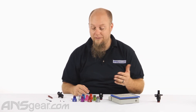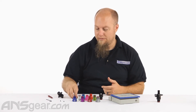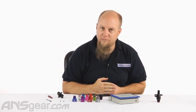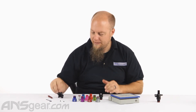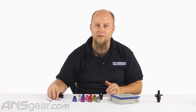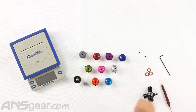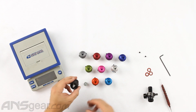If I reference the manual, three red shims give me the highest output pressure for a standard regulator — about 800 to 850 psi, I believe. And if I remove shims, I can reduce the output pressure all the way down to having no shims in it, which gives the lowest output pressure — about 450 psi or so. So make sure if you take out three shims or you take apart a regulator that has three shims and that's what you want, put three shims back in.